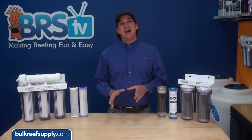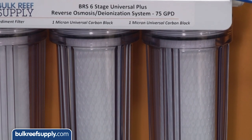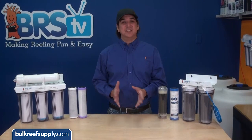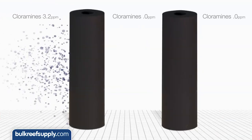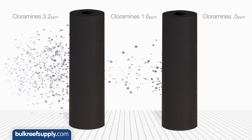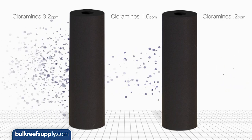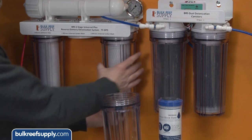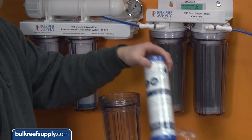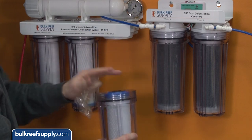So how about a couple of ways to maximize the lifespan of your filters and save some money. The first way is to use two carbon blocks in series, where the first carbon block does a large portion of the work and the second provides the final polish. The benefit is that while you might replace a single carbon block after 10 to 20% breakthrough, with two blocks you can leave the first one in — possibly all the way to 30, 40, or even 50% breakthrough — knowing the second filter will get the rest and last a lot longer because it is handling a reduced load. Most people will likely replace both filters at once, but if you really want to maximize your dollar, you could move the second filter to the first spot and put a new filter in the second canister.